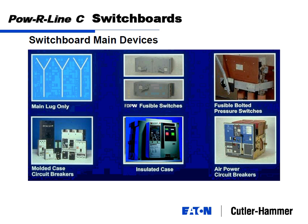From a circuit breaker standpoint, we've got basically three types. We've got a molded case circuit breaker, and that's these. You can see it's molded case. It's an engineered thermal resin composite, plastic on the outside, and just a simple toggle mechanism on the front, on and off. Insulated case, we'll come back to. Air power circuit breaker is much bigger.